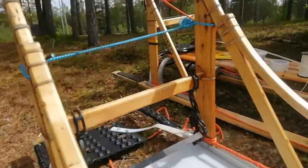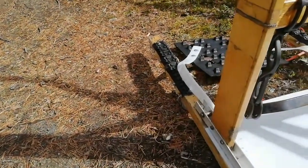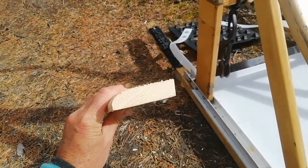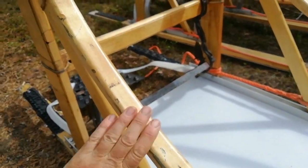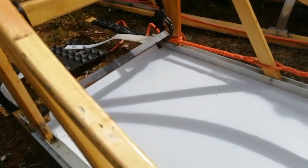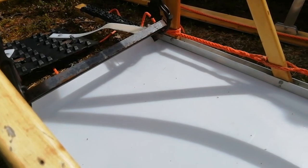This is the big Bjorkis toboggan and it's got a crack in the plastic — you can see it just there, it goes to about there. It can be reinforced either with plastic or wood. I'm going to add a bit of wood — this off-cut was rough-sawn four-by-one and I've put a bit of a bull-nose on it. It's good not to have sharp edges; we don't have any sharp edges on the sleighs anywhere. Once this is oiled you won't notice it so much, and it's a lot more comfortable for clients sitting in there since it's rounded.